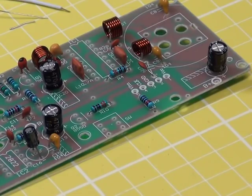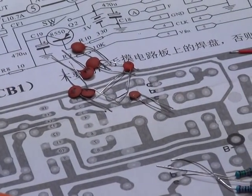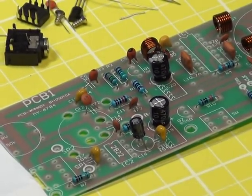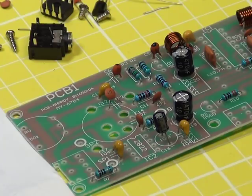We've populated a few more components on this board. We've done the resistors, the ceramic capacitors, the electrolytic capacitors, and the ceramic resonator and ceramic filter. What we've found is all the 104 capacitors, instead of being 100 nanofarads, they've been around 56, so they were out of tolerance. There's a pile of reject capacitors there, and we've replaced them with monolithic dip ceramic capacitors which we have in stock. It's just been the 104s that have been out of tolerance.